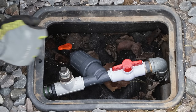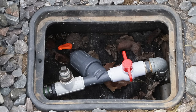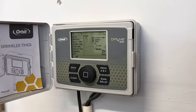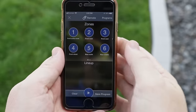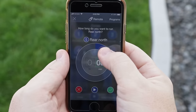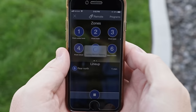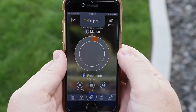The first thing I'm going to do down here is turn this valve to the off position. Next, I'm going to open up one of the stations in my system — it doesn't matter which one, I'm just relieving the pressure. Generally, you'll need to go and turn on one of these stations in the garage or wherever your control panel is. My control panel is one I can also control from my cell phone, which is super convenient but totally not necessary. All you need to do at this stage is open up one of your valves just enough to relieve the built-up pressure from the irrigation system.